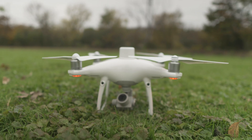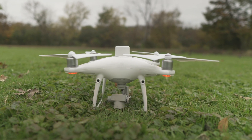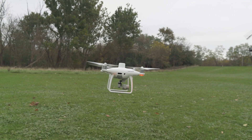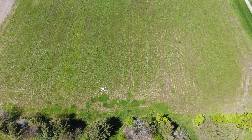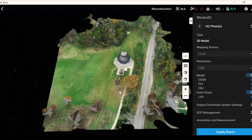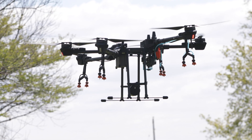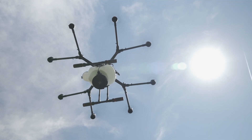It's what you can do afterwards that's powerful. If you're taking a Phantom 4 RTK, it's going to be regular RGB images and you're making your map. From there, you can actually export that map to, say, a T16 or an MG1P spraying drone. You can mark obstacles — so it goes around the barn, around the big oak tree, or whatever you don't want to spray — and then it will follow that path and spray.